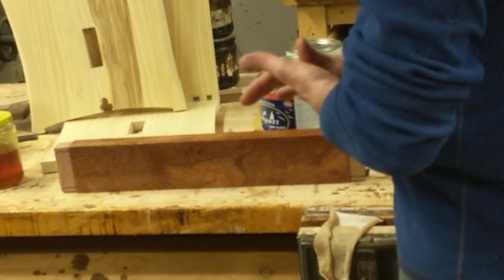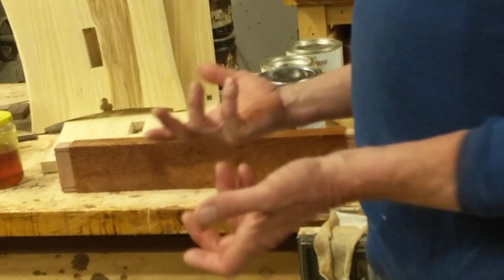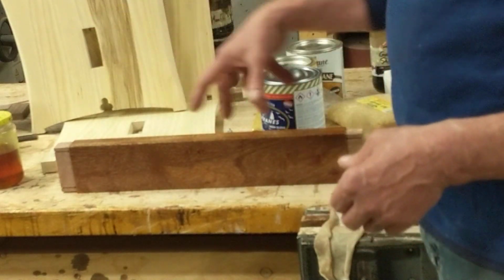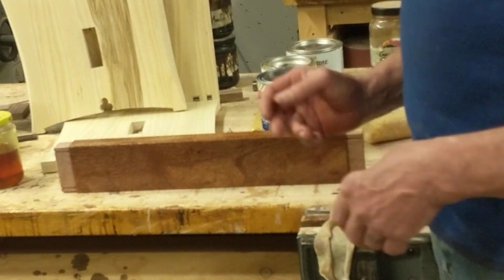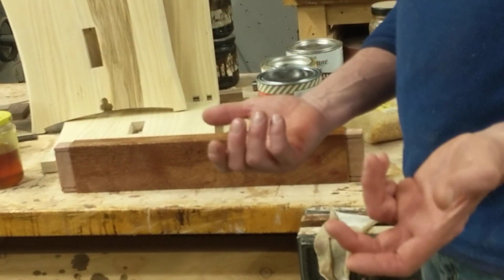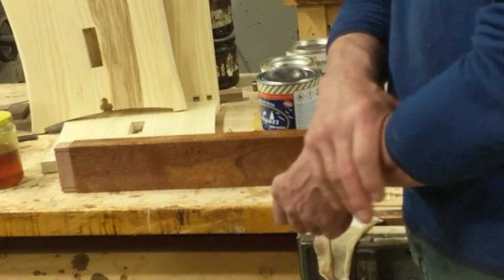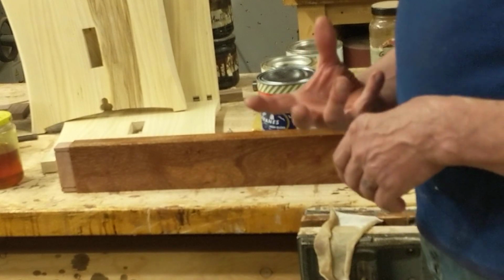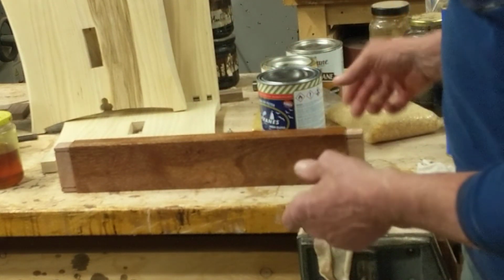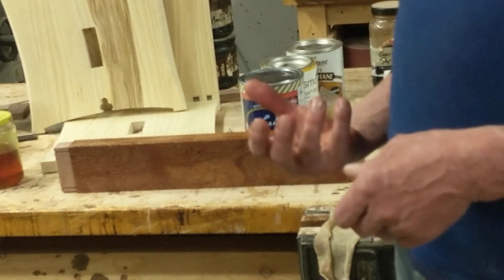Anything else? So there's an aspect called finishing the finish. What a lot of people will do after they apply one of these finishes, they'll buff it out either with a Scotch-Brite pad, 4/0 steel wool, something to take off those dust nibs and whatever other contaminants or bumps have gotten onto the finish, and then they'll apply wax over top of it. If you have a high gloss finish like the regular Epifanes, you can also take steel wool or a really fine sandpaper.